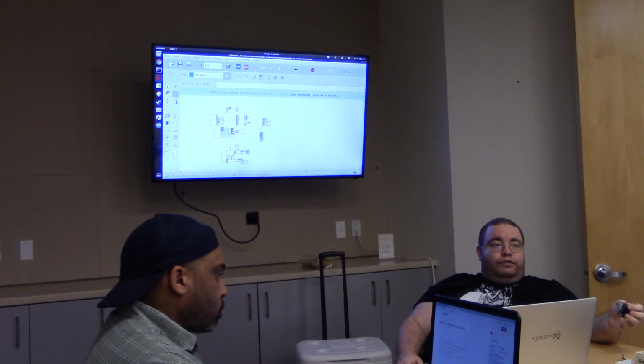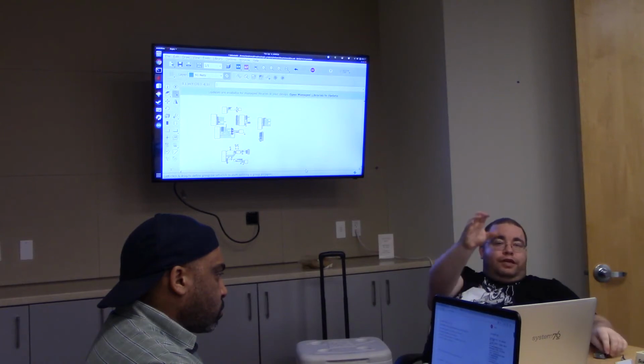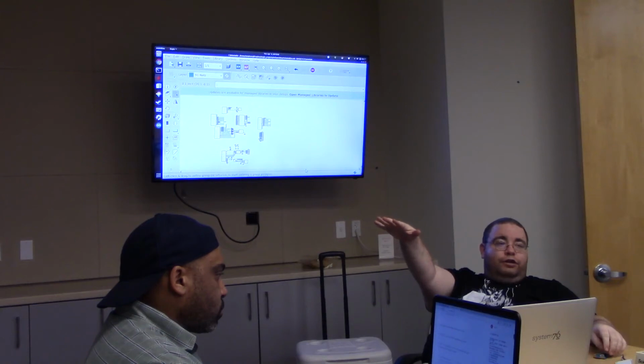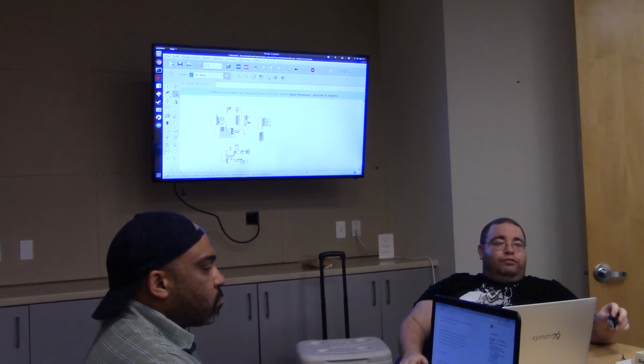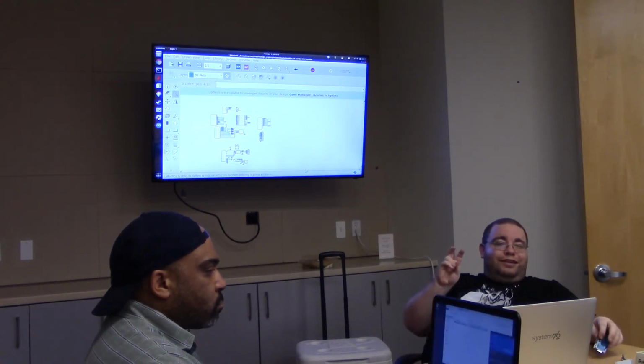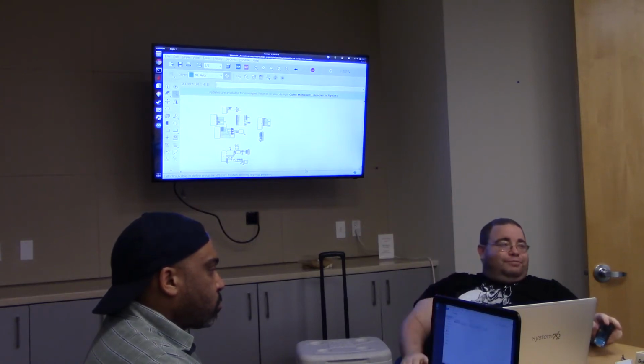For 4 bits per pixel, there are a few different ways of doing it. You can do paletted, where you've got a full set of 9-bit colors, and this value in 4 bits, one of 16, corresponds to this 9-bit actual color, and then offer instructions to change the palette. You can also do what a lot of systems in the 80s and 90s did, which is RGBI. You have 1 bit each for red, green, blue, and then 1 bit for intensity, which either makes all of them brighter or all of them dimmer. It actually doesn't look half bad.